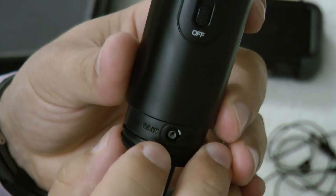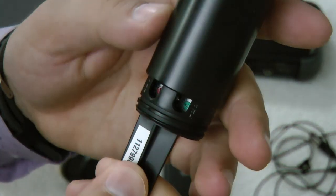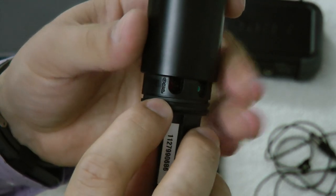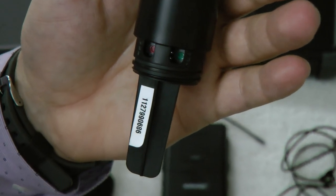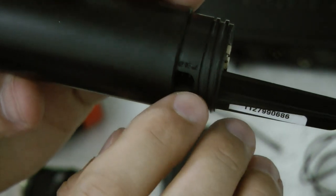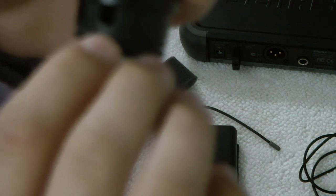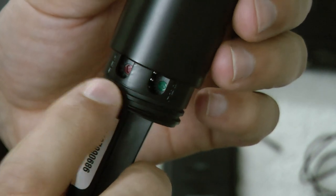We've got two more pots. We have GRP — it is a red pot — and because we're close to Christmas, we also have CHL. So I'm guessing channel. So channel and GRP, and there are numbers around that pot. You're supposed to select a number. I think on the backside it asks for a channel number, so if it's 11, this pot has to be selected to 11 on the channel side so it transmits on the same frequency as the device.